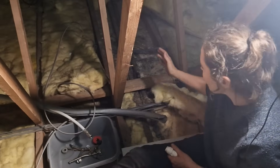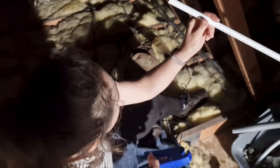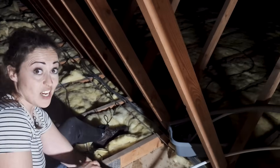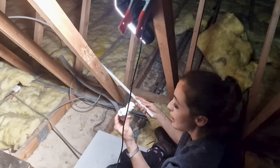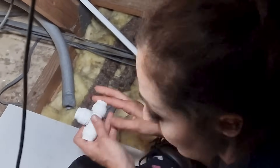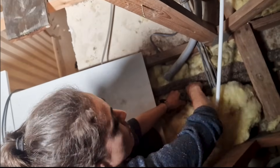I found that when you buy them from the shop the very first edge is very rough. The insert is going in there — now it's in, it's tightened. I'm going to go back to the other end and connect it to the T-connector that I need to replace. I want to attach it on that end and then replace that fitting, but I've got to cut this pipe here first and put all of that together — then that should be it and we can do some tests. I could do with a lovely hot bath.